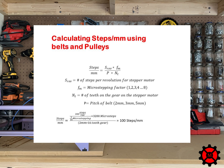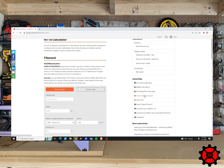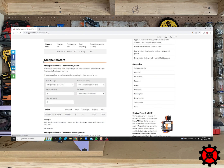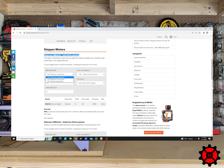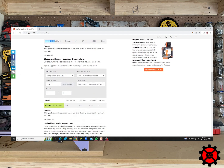This is a good starting value to get your printer up and running, but you will need to fine-tune it as you begin printing. There is also an online calculator for steps per millimeter values found at the RepRap calculator original Prusa i3 site. Click on the RepRap calculator to load all the calculators — we want the stepper motor section. You can input the motor step angle of 1.8 degrees, the driver microstepping of 1/16, the belt pitch of 2, and the tooth count of 16. The results confirm our math: 100 steps per millimeter. This calculator is quicker than doing it by hand, but now you know the math behind it.